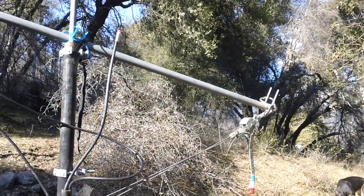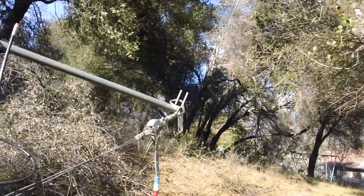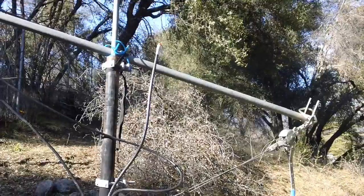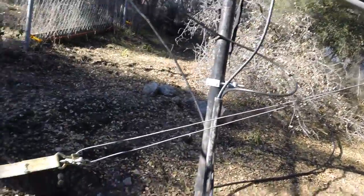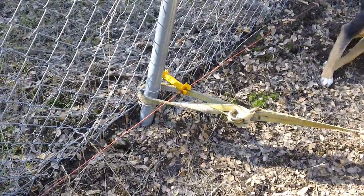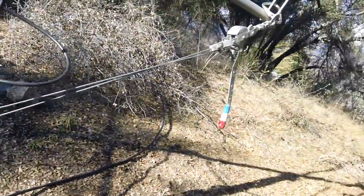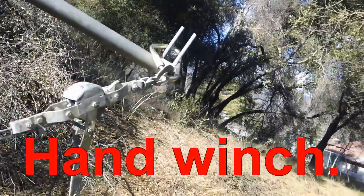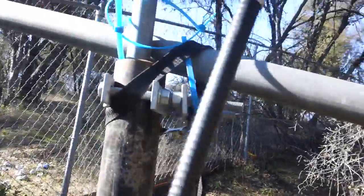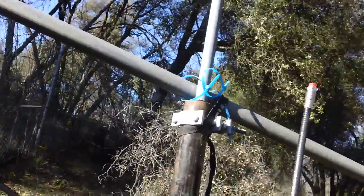Physics is not on my side to hoist this antenna up the pole — that is 30 feet worth of pole. I'm supposed to lower this section down and everything should come up, but the physics of it won't let me do that, not by myself. So I conjured up this little field expedient solution. I got my chain link fence secured by concrete, some air force strap, and a hand pulley system with a crank connected to the bottom, plus a little bracket to keep it from slipping up and down the pole. This will be my pivot point to keep everything aligned. Let's see how it goes.